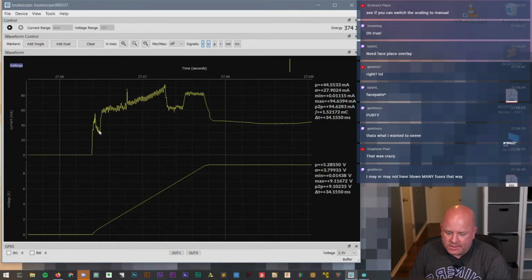does a current limit because the input capacitor is charged too fast. So this is probably the decoupling cap charging up, and then the regulator probably slowed down the charge, and then it opened it back up, and then it came back up, and then this is probably the first time the LED blinks. That's my guess, just because there's a pretty big change there. Or maybe this is when the micro finally gets active and going. Well, that's pretty cool.